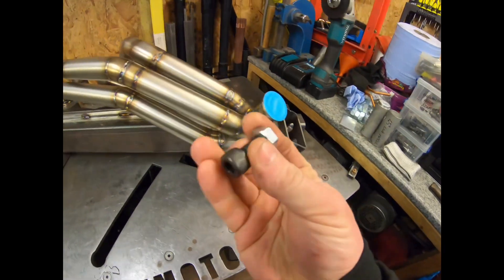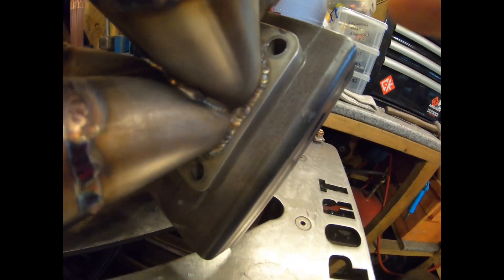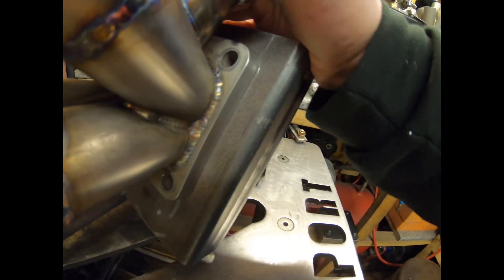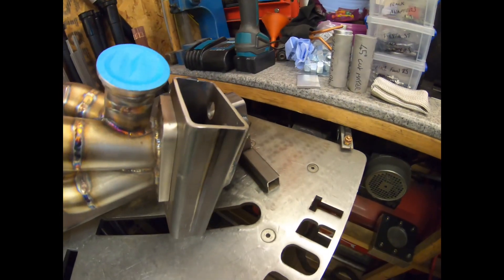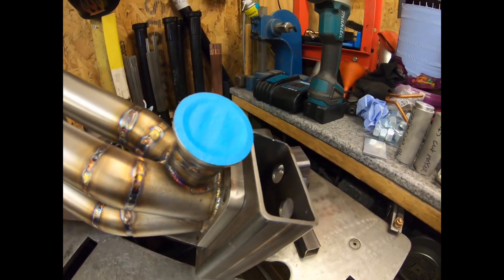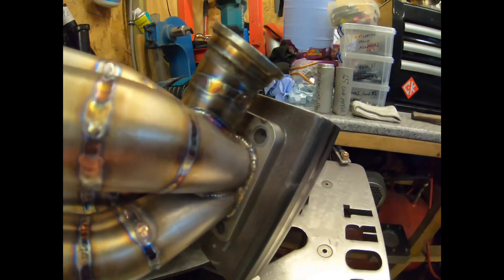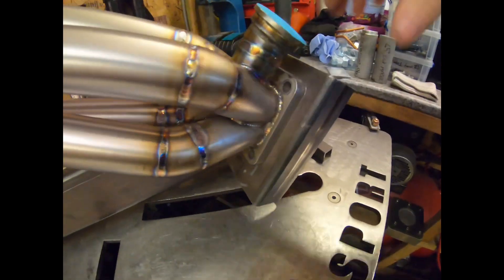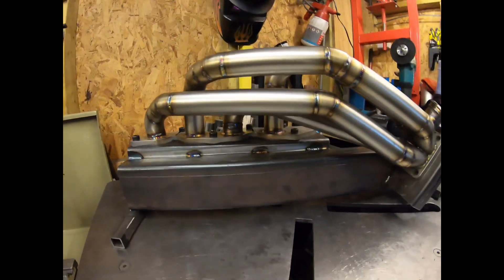We had this flange bolted to here with four M10 socket cap heads, and there's a tiny little bit of tolerance in it. If you can just see my scribed line there — when we've unbolted it, this is released, so the whole manifold is pulled in. We've probably pulled in just over a millimetre. Now I know that's not a lot, but that just shows you even with it bolted fully in place, that's the tension it's under. So we'll now release the flange and see how flat it has stayed compared to when it's bolted down.